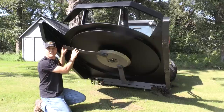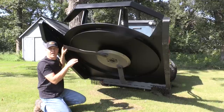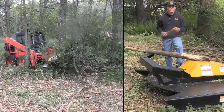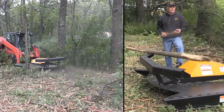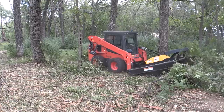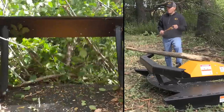With the mower hitting a high tip speed or high RPM, we have a tremendous amount of energy stored in the blades themselves — not just the stump jumper. When you have energy stored in the blade, you can more efficiently transmit that to trees and brush, meaning you can cut things down faster. This area we've been mowing is predominantly English buckthorn, mostly a few years old — between a quarter inch and one inch diameter, with a few larger clumps up to two and three inches. English buckthorn is an invasive species, really tough and hard wood, requiring a lot of tip speed and energy to break down. This mower is doing a good job of mulching the bits up.